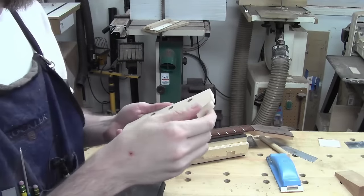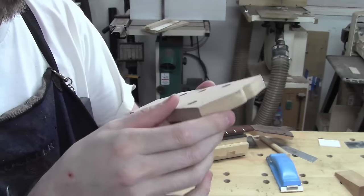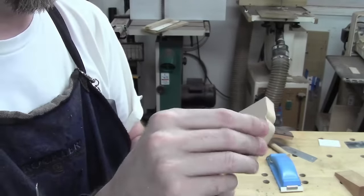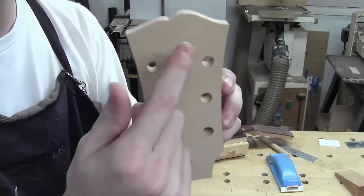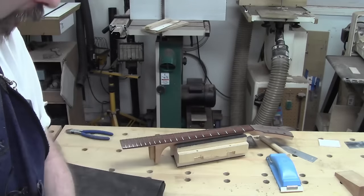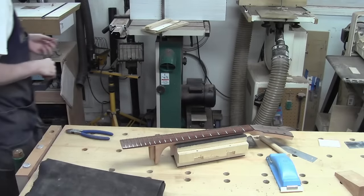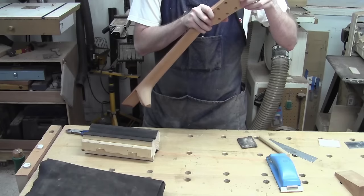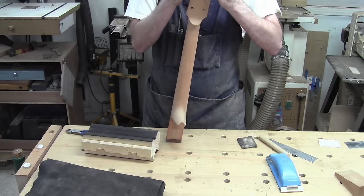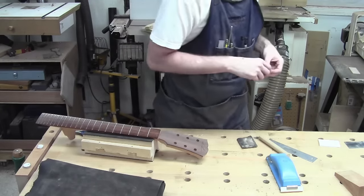Our test piece — I glued in my test piece. That's walnut sapwood into MDF, which is not a great test but it's sufficient. It let me know that I got my depths good — it took a little bit of trial and error, this is the second try on the inlay. Anyway, that's the trial, and I've got this cut in the curly maple. This is the negative that I'm going to use into the headstock. The fit is good — it sits a little bit proud, which is great. That tells me I'm going to have decent fill. I'm not sure how much of the curl is going to show through, but my fingers are crossed.